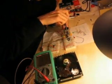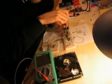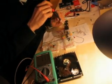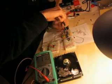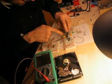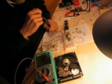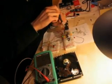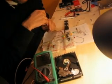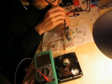You can see that as it turns up in more RPM, the current is going down. I'll demonstrate — 1.12 ampere. We're at the end of the range; my potentiometer cannot go any further. It's now at zero ohm and it's shut down completely, so I must turn it back. I will reduce the capacitance here by taking out the one microfarad capacitor. This is now going much faster, and so is the motor. Now let's see what the current does if I turn it up again. The sound from the buzzer reminds me a bit of a small diesel engine driving up slowly.